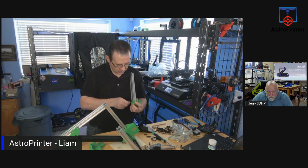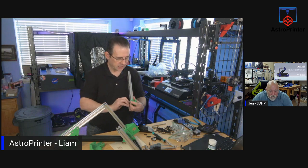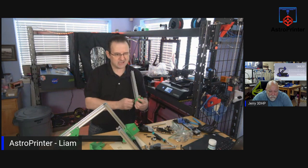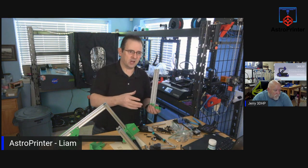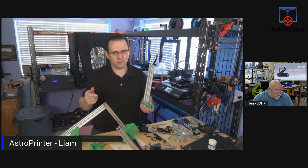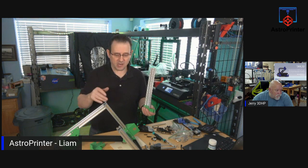Print clay. This will not print clay because this is an ordinary printer. This is converting an FDM printer to a different type of FDM printer. But ceramic printers, yes, they can print a type of clay. You have to get a special type of clay that kind of semi-dries as you print it. And then after so many layers, it has to start solidifying. If it doesn't, it'll just slop. But when it comes out initially it's more liquidy, like a thick toothpaste. And afterwards, you have to fire it to fully harden it.